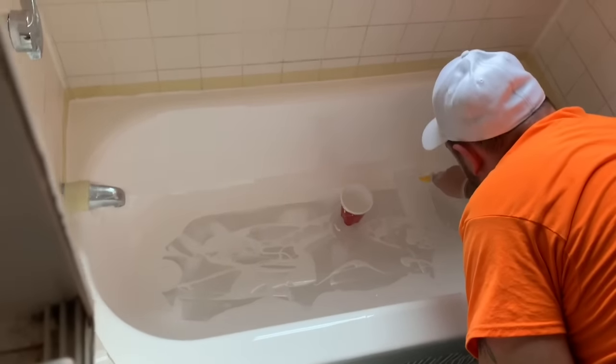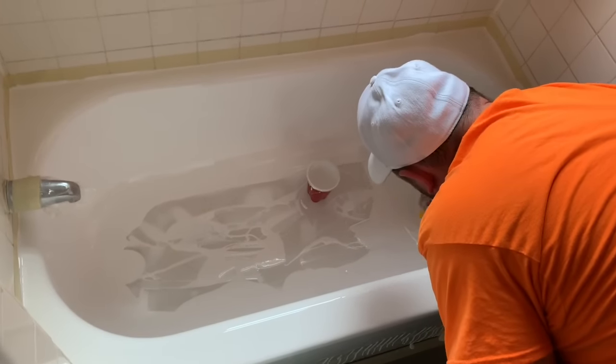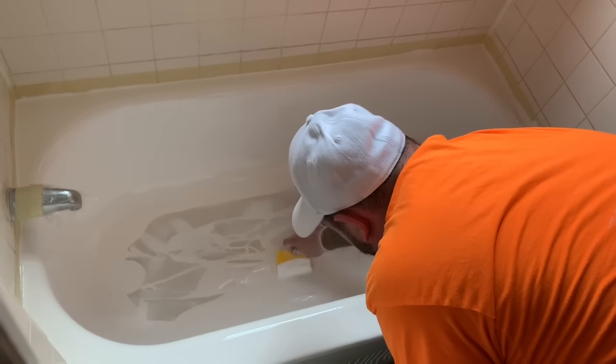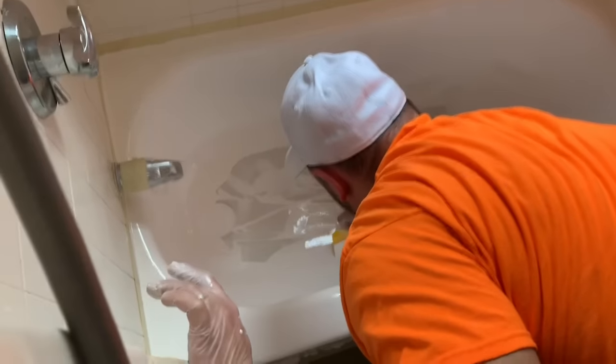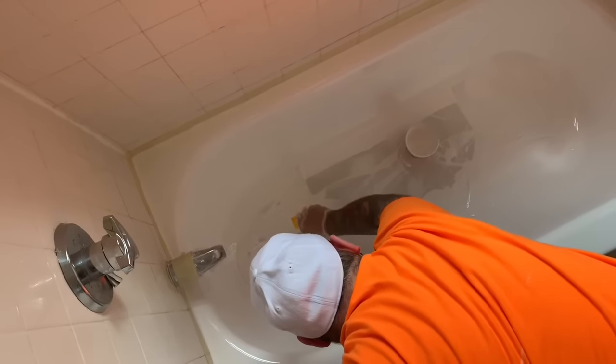The tricky part — this is one of them — where you want to stick the spreader in the corner and just level out all the bottom with the pooling on the edges. So I'm just lightly dragging the spreader across the pieces on the bottom. Don't worry if it's a little thicker in one spot or the other — it's going to level itself out, and we're also going to level everything out with the comb a little later. But for now we're just taking the pooling excess from the corners and spreading it towards the center of the tub. We're just moving material and leveling it out. Anything around the drain — that's where the pitch of the tub is going to be pushing everything down anyway. If you scrape an area there bare, by the end of the process it will all flow back in and cover itself.